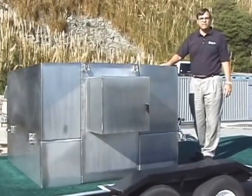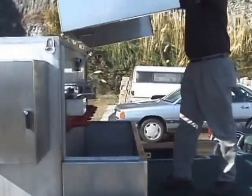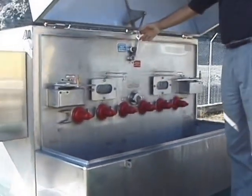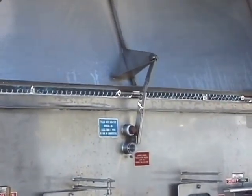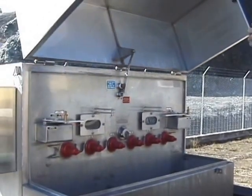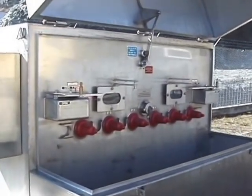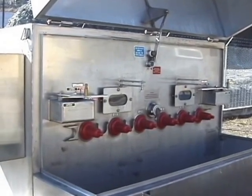Let me show you the switch side first. We have our easy opening hoods with our automatic wind stop latch that latches the hood automatically in the open position, so no wind can gust and unlatch it on the lineman. This is a typical 9-configuration unit, which means it's 4-way, 2-way switch, and 2-way with breaker.